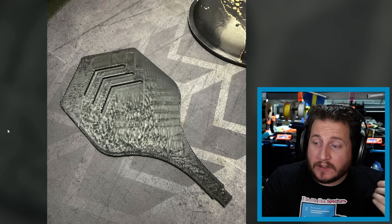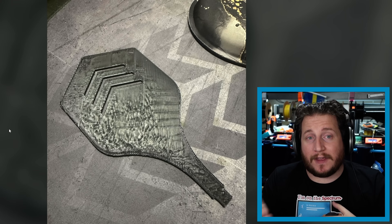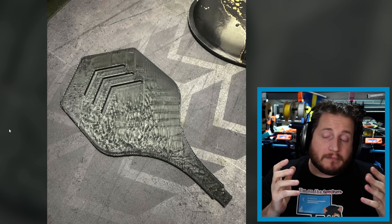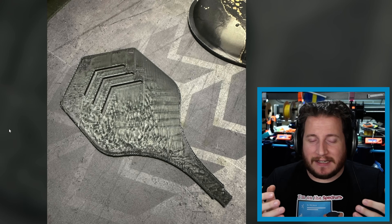This part is very thin, so being a little too close on the bed side of things could impact that top layer, especially on hyper-thin parts. Make sure that first layer looks and feels like glass. On textured build plates it's less of an issue, but this bed appears to be smooth — like a smooth PEI sheet. Keep an eye out on the next print: if that first layer has ridges, you're too close. If you have valleys between your lines, you're too far and need to bring that nozzle closer to the build plate.